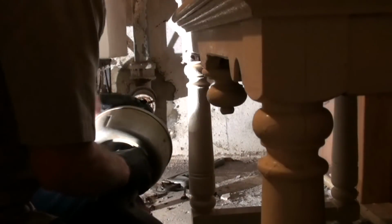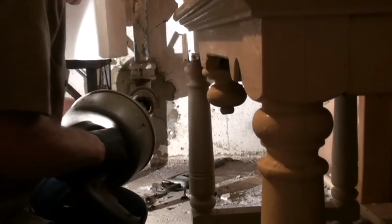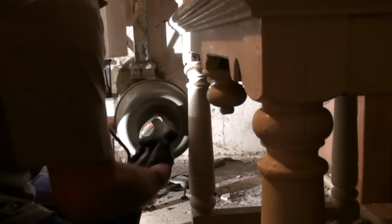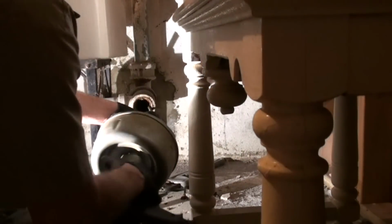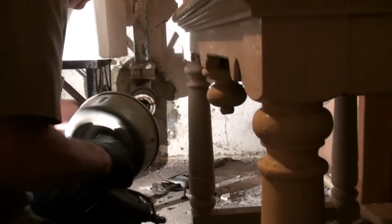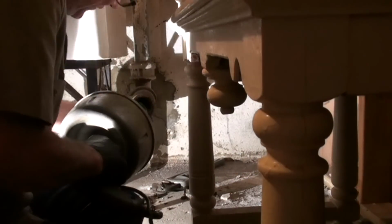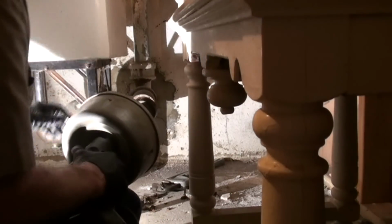So let's see how far we can get before we hit a bend. Okay, that's about 4 feet, so now I'm going to lock it and use the power past that bend. I'm working it back and forth to eat up any of these clogs. Now I'm able to feed it again because we're past that bend. Let's see what we hit next. It could be a pile of grease. It's feeling like it's slowing down. Or the next bend we're going to have to power through. But anyway, let's give it some...